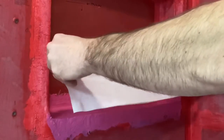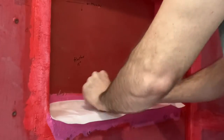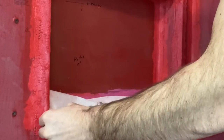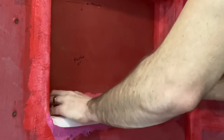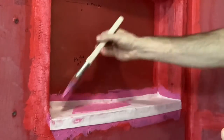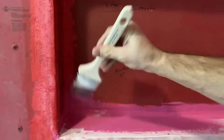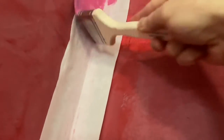I knocked down the ridges created by the brush strokes, applying it liberally. The brush is definitely the preferred route for the fiberglass fabric — you want the RedGard to saturate the fabric as much as possible, nice and even, and then paint a coat on over the top. The brush is my preferred tool for fiberglass fabric, corners, seams, the niche, and any change in plane.